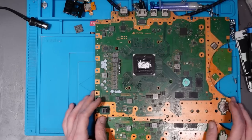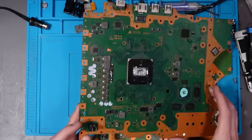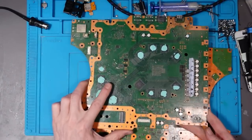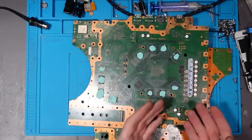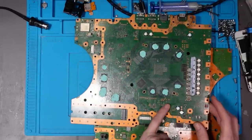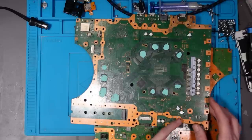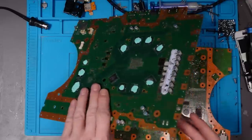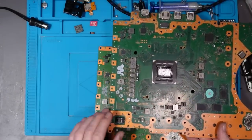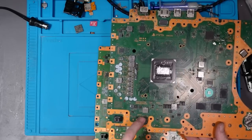The way to test that is to go on the back of the board. Make sure there's no power and the power supply is disconnected — slightly lift the board away from the power supply. Test around that area, and if you've got any short circuits there you're likely going to have a short on that side of the board. The bank of capacitors just there in the middle is generally going to be the cause.